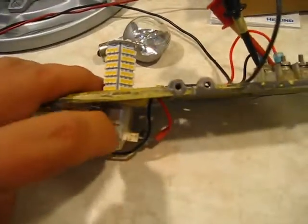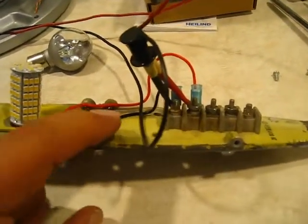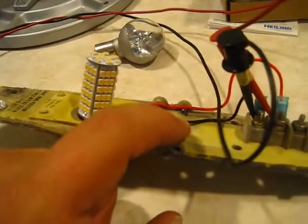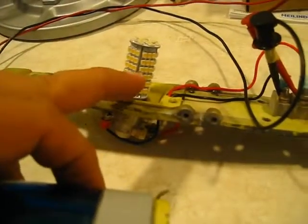This is a really high quality socket. You know, it's on an F-16, so it's not going to fall out. So then I just ran these wires out. I pulled out the transformer here. Again, that went from 115 volts AC at 400 hertz down to 6 volts AC to run this bulb. Okay, so if we turn this guy on, you'll see we're pretty bright. This is a white bulb because this cover here has some green glass on the side.